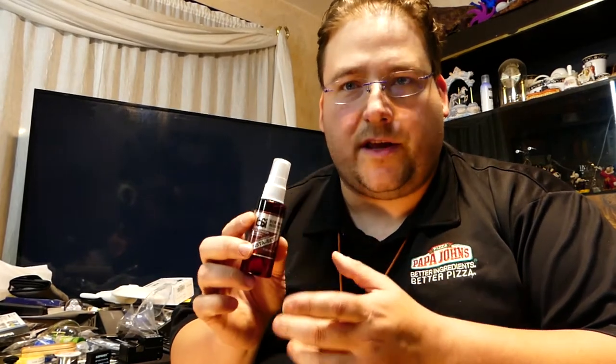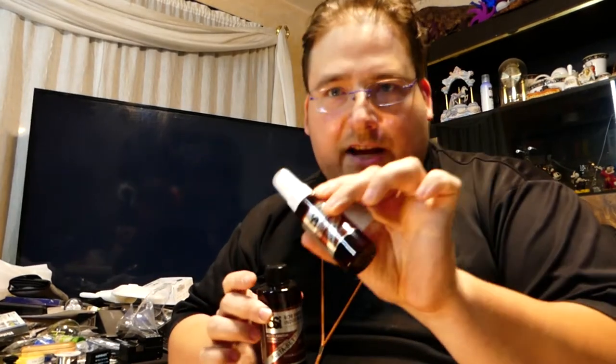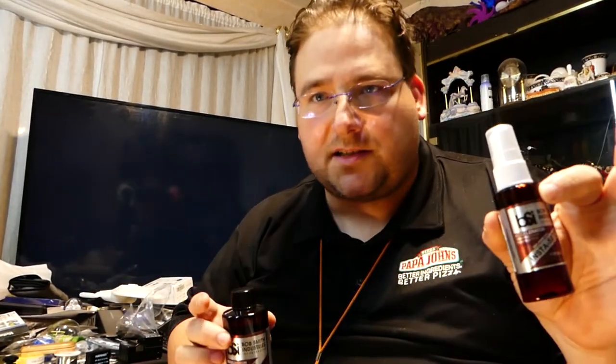This is the only brand. I've been using this for 20 years. I even bought a big giant bottle so I can refill my bottle, because this bottle will last you months and months with 3D printing, because you need so little. But I also build rockets and airplanes and stuff with CA glue. I use the rubberized stuff, the black CA glue. They call it tire glue, but it's got rubber in it, so it has a little give. It's not so brittle. For 3D prints, that doesn't matter, though. Just use whatever CA is available. But this is like $7.